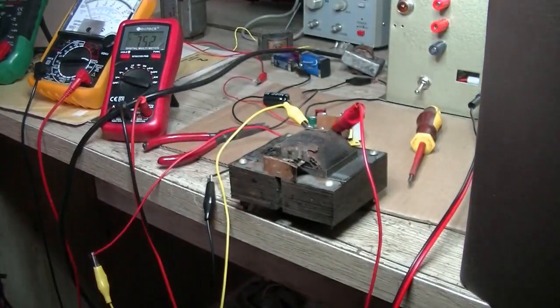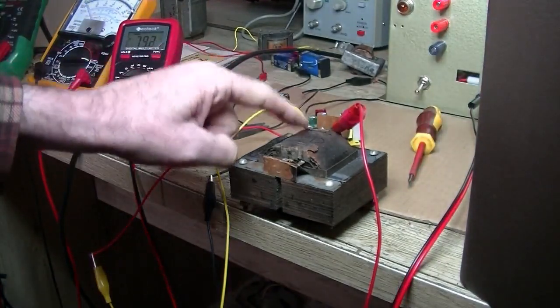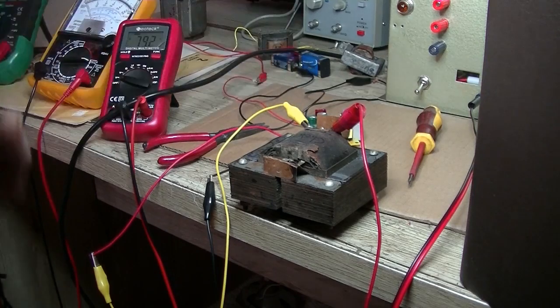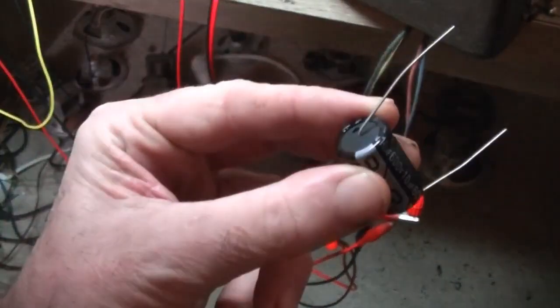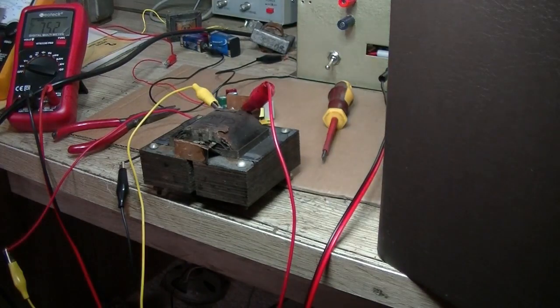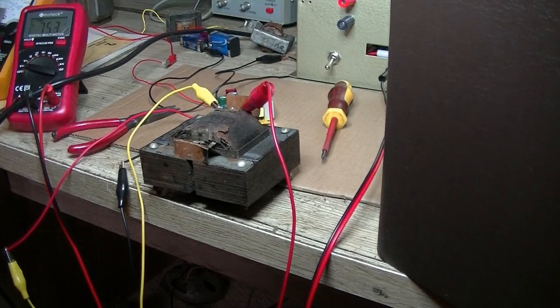It's still there though. That's just an old transformer I've used as a choke - I think it's about 900 ohms resistance. Then I had a brainwave: what if I bridge the positive and the negative output from the module with an electrolytic capacitor? I thought, I can only try. I'll bridge it out - positive to the positive lead, negative to negative. And here we go - loud voice on ABC. It's a hell of a lot better.